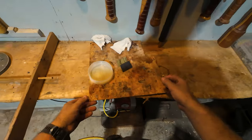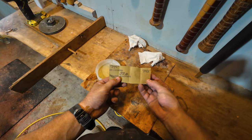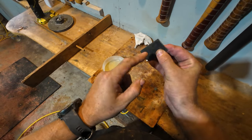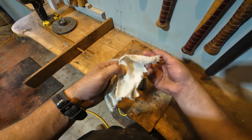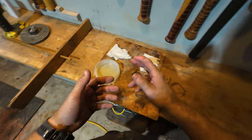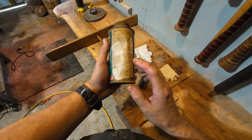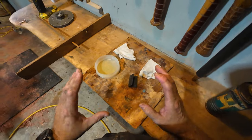Over here I'm all prepared for wet sanding. Because I've stopped at 240 grit, I use a wet and dry sandpaper — I've got 320 grit here. I fold it up so none of it is touching when I'm using it, because your fingers will burn when running it across trying to build up that slurry. I've got two pieces of towel here — just make sure it's not the mother-in-law's. I'm going to use Organ Oil — an Australian product — high-speed finishing natural oil for woodturners. It is beautiful stuff, just wait till we put this on.